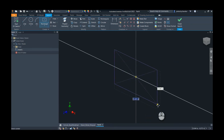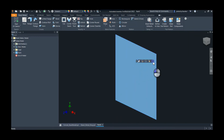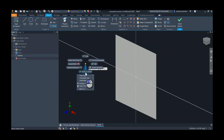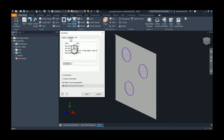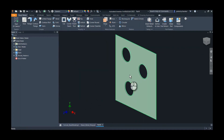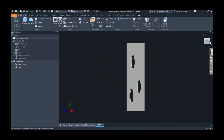It's a pretty big plate, so of course you would carefully position these where they needed to be, but we're going through it quickly. I go to my workspace, find that punch — there's my ferrule feature, hit open. We could play with all sorts of stuff here and change it. One quick thing: you can ask it to represent it in different ways, but ultimately it depends on the flat itself. We hit finish — there is the feature. Now if we had applied fillets, you'd have to go back and pick the back face, so that's why I don't bother with that. Now we create the flat pattern and we're like 'wow, it didn't seem to do anything.'